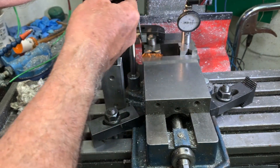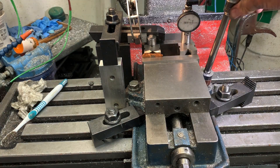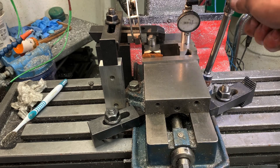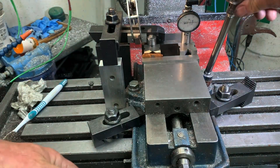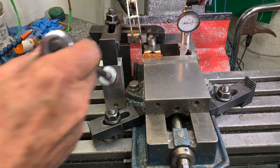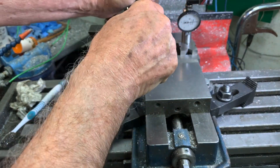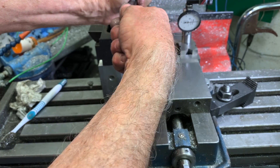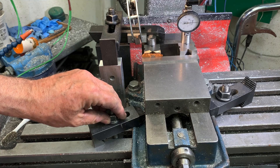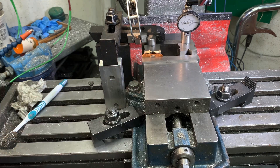If it does move, it's really more that the table is shifting. I'll be careful not to bump the indicator. All right, so I've tightened this down — not crazy tight yet — but you can see the vise is not shifting because the hold-down clamps are in control. Now when I release the hold-down clamps the vise shouldn't move.